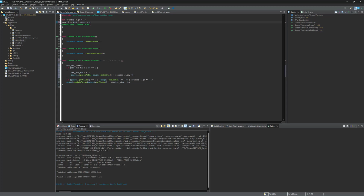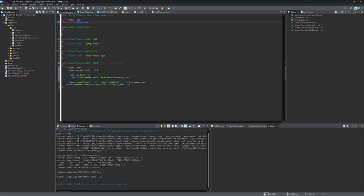I'm gonna extend the variable and assign it to the gauge value. As the refresh rate is 60, when we count up to 60 here, this code means that we are gonna update the counter every 1 second. Since the RPM is round per minute, we should multiply the value by 60 and initialize the RPM counter for the next period. Let's make the connection.